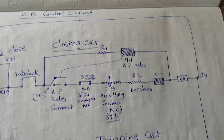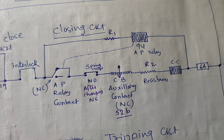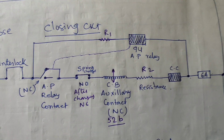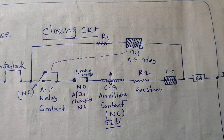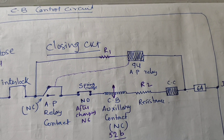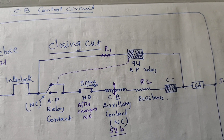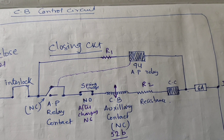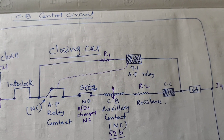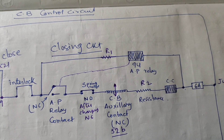The anti-pumping relay is very important for the safety, for the property loss savings, and for the hunting effect prevention. The anti-pumping relay is used parallely with the closing path of any circuit breakers used in the world. It is most important to prevent the damage of the closing coil, interrupters, or for the safety of the working personnel in the substations, wherever you are using circuit breakers for protection aspects.